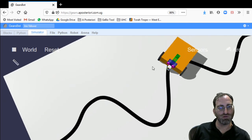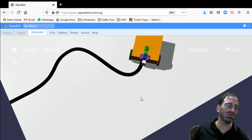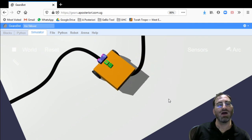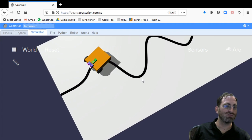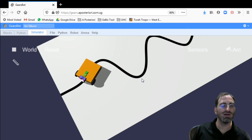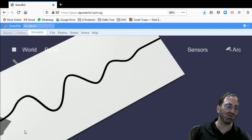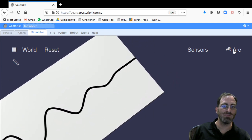Over here it almost falls out of the line but manages to stay within, and it will complete the last curve successfully. And so you can see that even when we're tracking the opposite side of the line, we're pretty much having the same successful solution and the same behavior. And it just depends on the geometry of the line of our challenge. Like I said, there might be cases where, if you have more sharp turns on the inside from the perspective of the left or the right edges, then you might want to pick the other edge as your best solution.